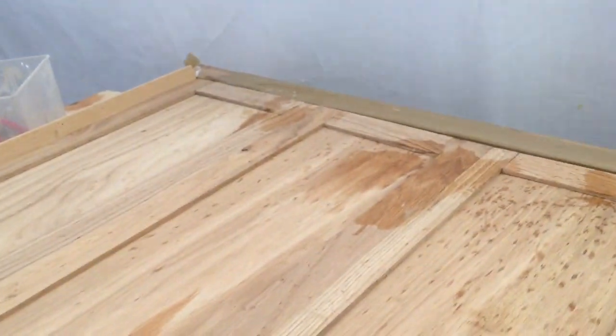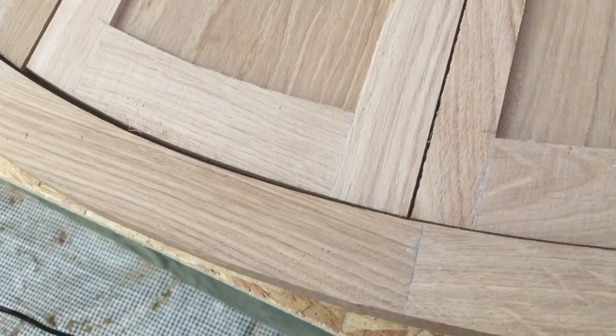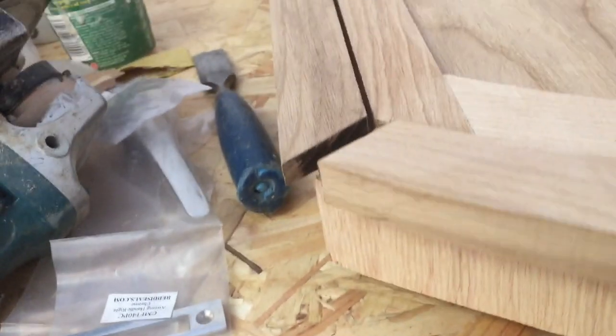We've got one more to take out of the clamps here — I've had the shutters clamped up overnight where I glued them together. They're easy to glue up in the frame. Got a bit of water dripping down today — condensation coming off the tent ceiling. This is the last one. What I've done with the others is stuck parcel tape just inside so the glue didn't stick to the frame. I've sanded all the doors up and trimmed the top rail — now I've got to cut this rebate out around the top so it matches the rebate here.